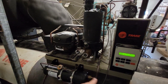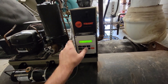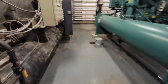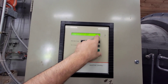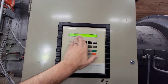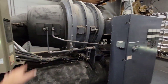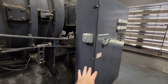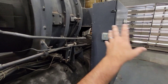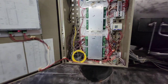This one's doing okay on the purge - it hasn't had any leak issues - but the buttons on this purge unit just aren't quite driving right. You can get them to work but it's kind of a pain, so I'm going to recommend we try to get that fixed. Overall we're doing okay - our approach temperatures look really good. We're only doing about a five degree split: 46 is our set point, we've got 50 entering. This chiller is running beautiful, if you can't tell by the audio - sounds absolutely incredible. All of our control linkages are good. We do have a starter in here with a bit of a buzz - the cores on the coils tend to get weak and start vibrating over time. These are 1985 machines.